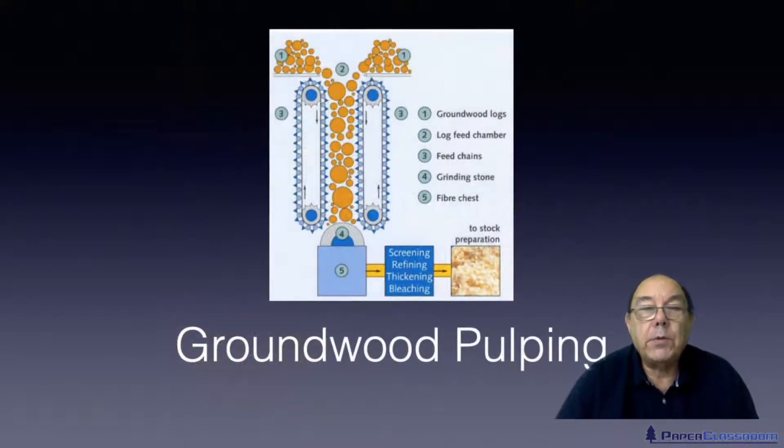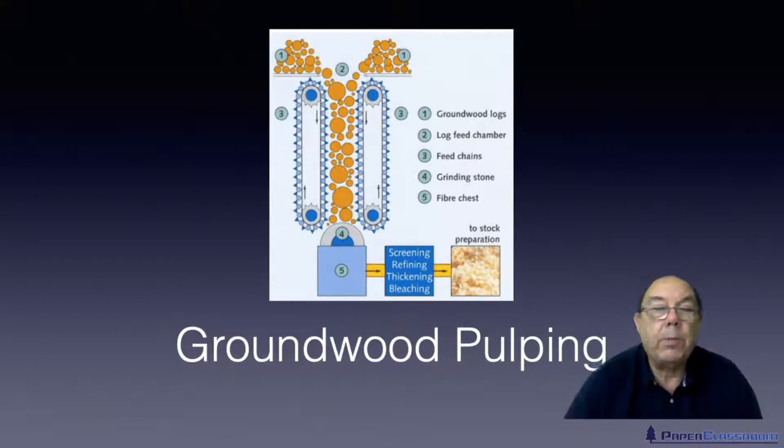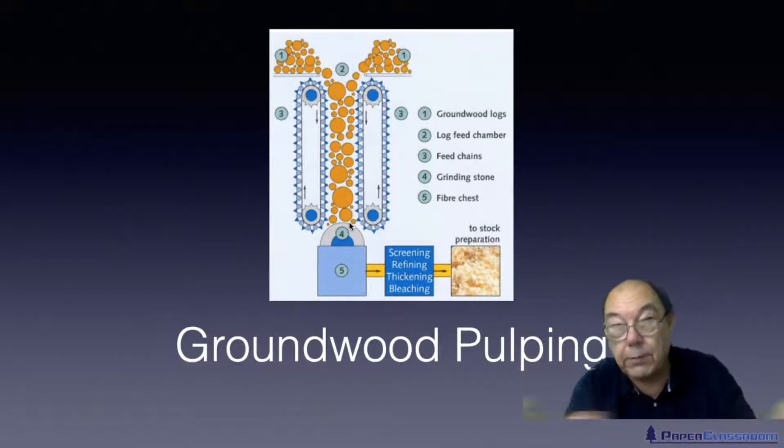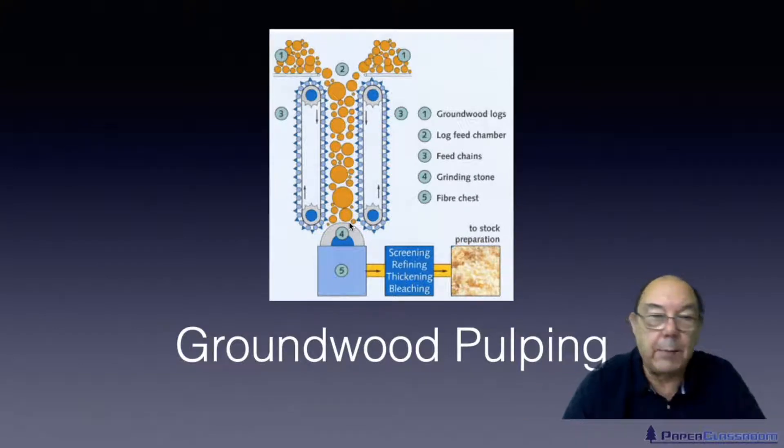It was Keller in Germany who set up the first mechanical pulping method that we called SGW — stone ground wood. He had a grindstone revolving quite fast in a trough of water, loaded with logs that had been previously debarked. The pressure of the logs against the abrasive surface caused heat, which softened the lignin, allowing the surface of the grindstone to rip out those fibres. As the grindstone meets the water, all the fibres are washed off, a clean surface is returned, and the whole process is repeated.